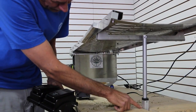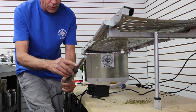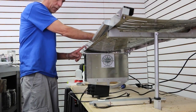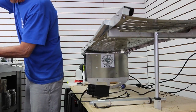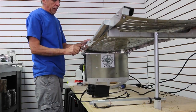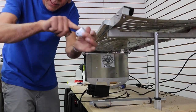See how it's coming back up. This thing leans forward. You've got six inches — take a sharpie and measure three inches and bring it down right to there. You do it halfway. The reason: you start with it level, when you push it this way three inches it rocks that way, when it comes back these actuators mount to the little holding pattern. Take this nut off — the furthest one before the housing. Real important: you want to leave it with the 45-degree angle so when you get any rocking you have a space there. If you mount it straight it's going to bind up on it.